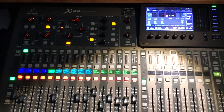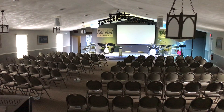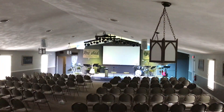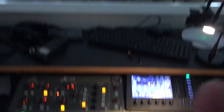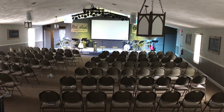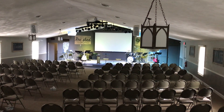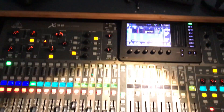Think of audio signal coming from that acoustic guitar up there like a bunch of hoses or pipes connected at various junctions, going from all the way up there on the guitar, through all the machinery back there, and then in the wiring overhead, feeding into this board. The board then feeds to the outputs, back up to the front where the amplifiers are connected to the speakers that actually produce the sound. If any of those many pipes or junctions are off or not working or set incorrectly, any of those factors can cause you to not receive signal. Between the guitar and the speakers making noise, there are a lot of intermediate parts.